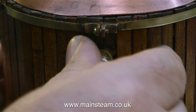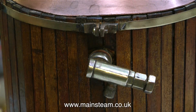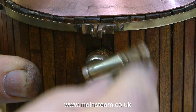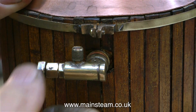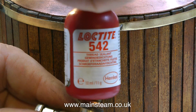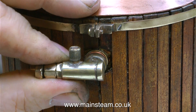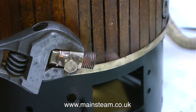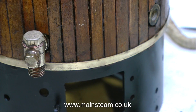I'm fitting the steam fittings to the steam boiler. This is the little whistle valve that's at the front of the boiler. A quick word about fitting fittings to boilers — it's not as easy as it looks because generally speaking they have to be in a set position. For instance, this whistle valve has to have the threaded part uppermost. And what you must never, never do is over-tighten a fitting if it won't quite make the position you want. The best way is to use shim washers — washers of different thicknesses that you can combine to get the right gap between the part and the boiler bush. If you do over-tighten fittings you're more than likely going to snap the thread, leaving a broken thread in the boiler bush that needs to be removed and requiring a new fitting.